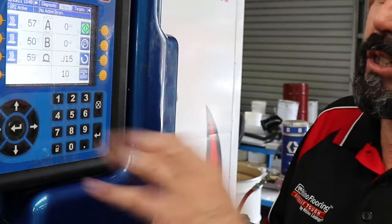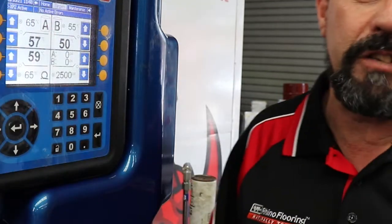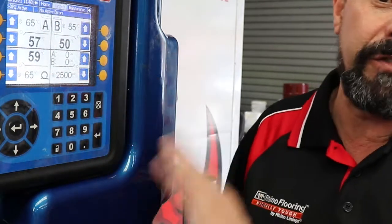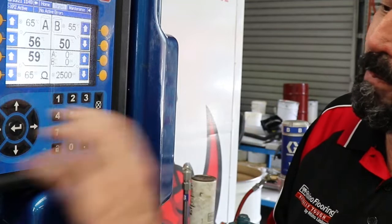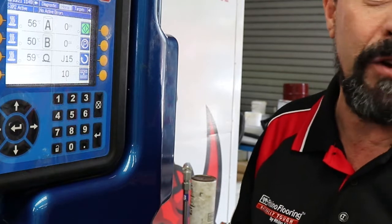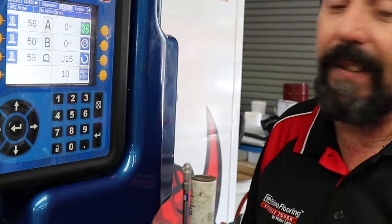If you want to heat the drums up more quickly next time, go across one screen and bring it up to about 75 — that heats the drums up really fast, especially when they're full, as it takes a fair while to heat up. Then bring them back down to the designated temperatures: 65 and 55. You can also put it in job mode at about 15 strokes, which is maximum speed — that gets the fluid flowing a lot quicker while still on recirculation and heats the drums much faster. Once they get to 45, bring all temperatures down to the designated specifications and then start spraying.